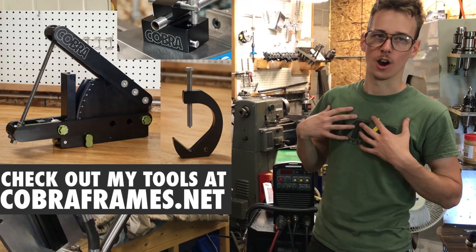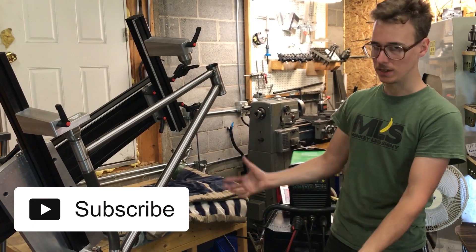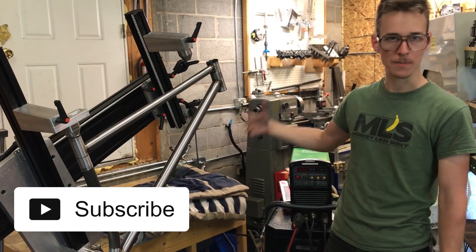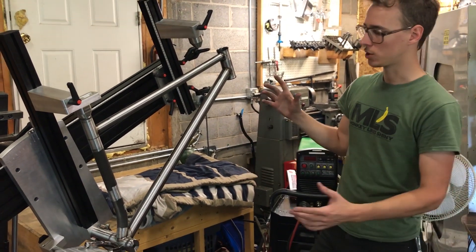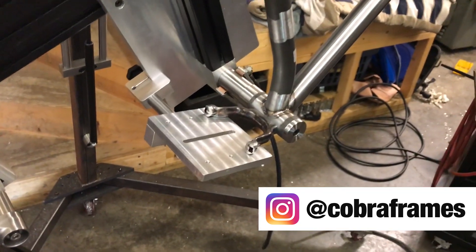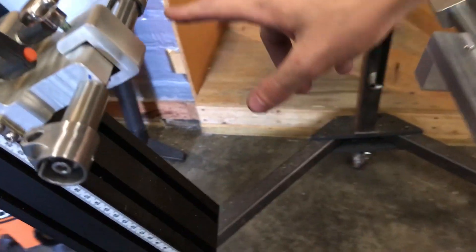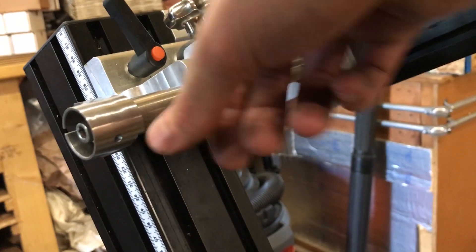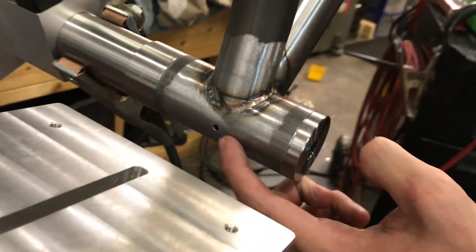If you're new to the channel, my name is Joe and I make tools for bike frame builders, but I also make videos like this mountain bike build series where I'm showing step after step how to design and build a mountain bike. Where we left off, I had just mitered the rear end tubes and bent them. Now I did a little bit more work off camera — I drilled vent holes in these dropouts so that the gases from the inside of the chain stays can pass through. I mitered a little bit more off of this to get it where I wanted it, drilled a vent hole down here, and then I set it all up in the fixture.